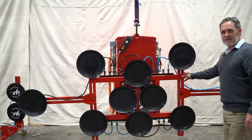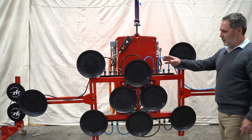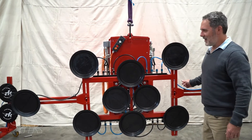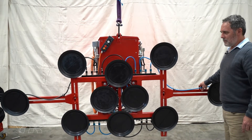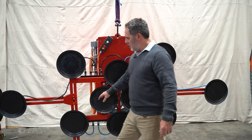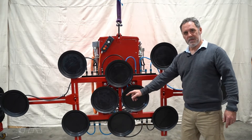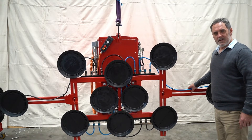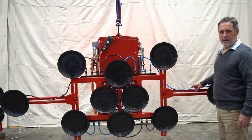Here's the lifter with two extension arms — one on the blue circuit, one on the black circuit. Extensions are really only needed when lifting longer panels of glass. For lifting fins, we can use four pads in a line with the other pads disconnected. The extensions are also good for stabilizing against deflection when doing roof glazing where there's potential for glass bowing.